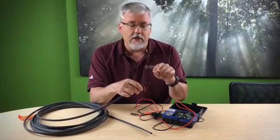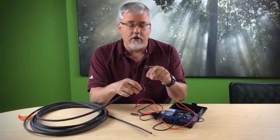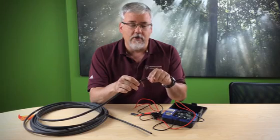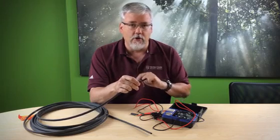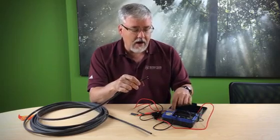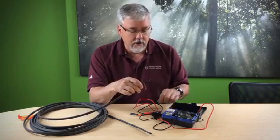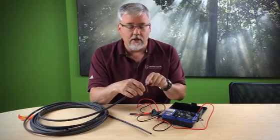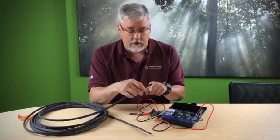All we're doing is we're making sure we're doing a test on this conductor to ground to make sure there's no continuity in the roll. And we're also going from this conductor to ground to make sure there's no continuity at all. What you want to do is set this mega ohmmeter to the 500-volt selection, then test it to make sure that either one of these wires is not making contact with the ground.